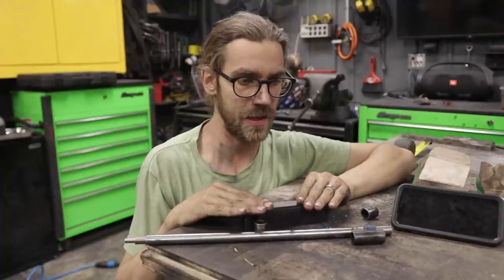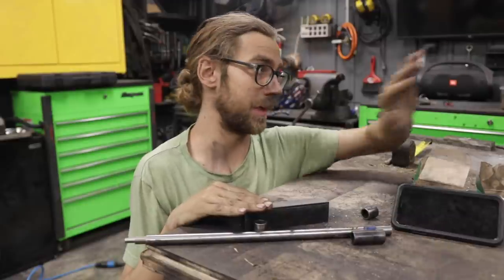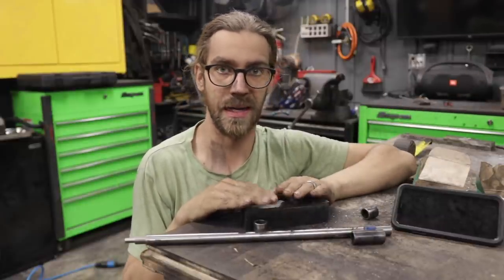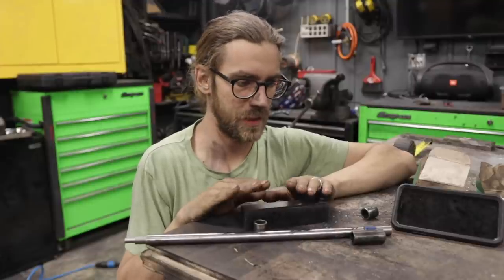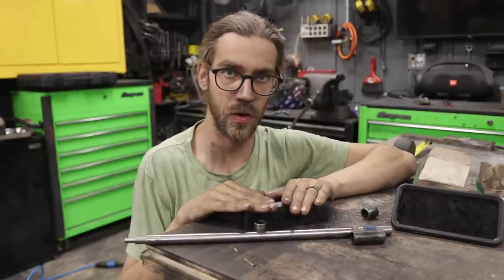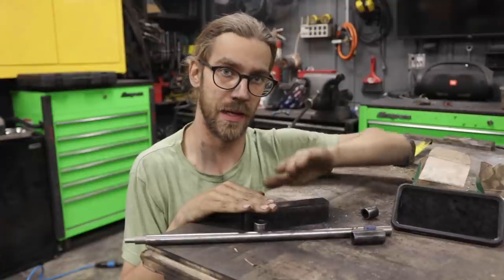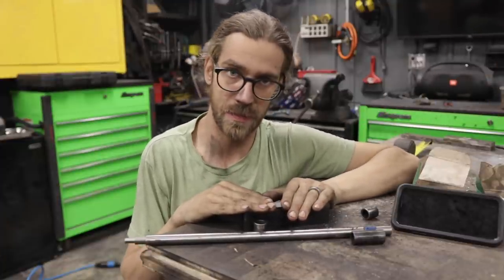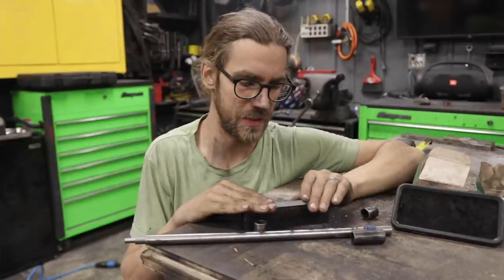If you look at a lot of the other designs with the tension on the handle, like Alex Steele's design, he actually uses the tension in the motor, and that's how Travis Wirtz does it as well. That way, it can keep things simple. However, I wanted to keep the motor rigid mounted to my half inch plate. That way it wouldn't move and it would be very solid. So we're gonna attempt to do this and see how successful it is.